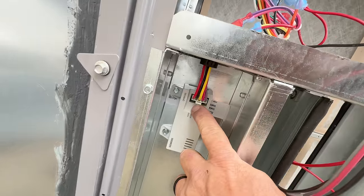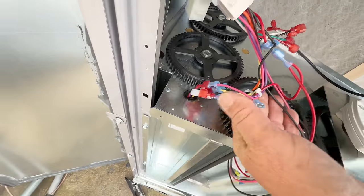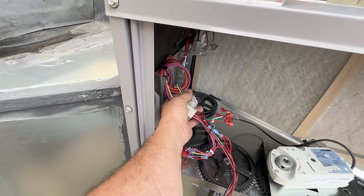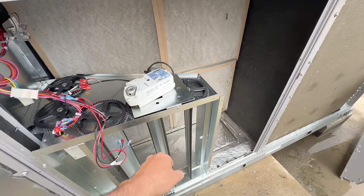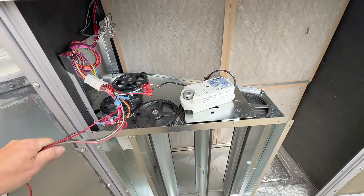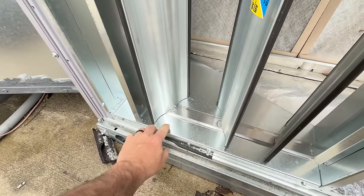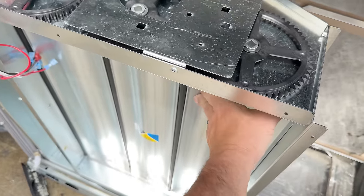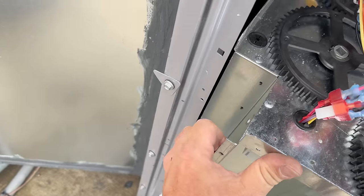Here is the actual outdoor temperature sensor — it plugs in here and comes up to these connectors: pink to pink, yellow to yellow, red to red, purple to purple. There are leftover wires in the longer harness that won't be used — don't worry about it. The economizer is not turning freely — you can see it's binding and digging in. They should put a Mylar plastic piece on the bottom so it slides across. Once I got it freed up, it turned nice and easy.